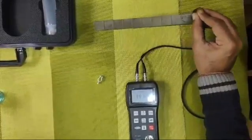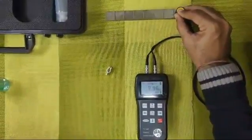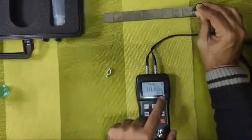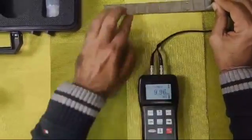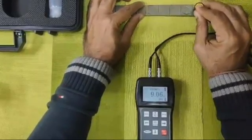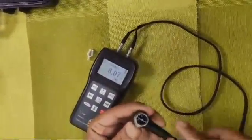The reading shows 9.98. The reading is correct. It is very important that you get the coupling sign displayed on screen, which means the probe is coupled. If you press slightly more, the readings change — that is why I am giving you an idea of how to check whether it is giving a correct reading or not.